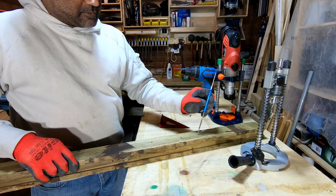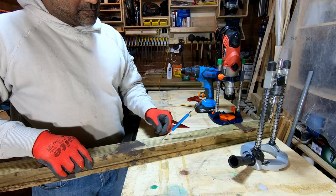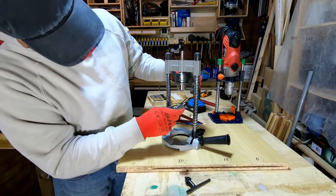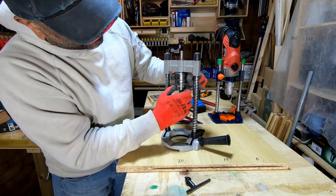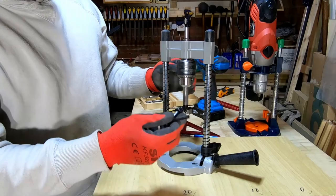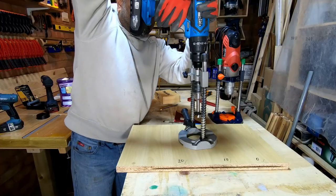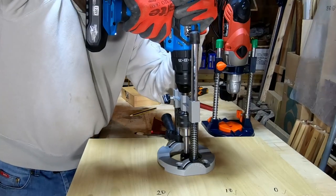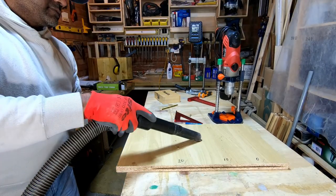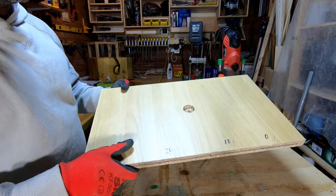With 90 degrees — no surprise — it's actually pretty good. One of the major reasons you'd use this kind of jig is when you don't have a drill press, or when you want to drill a straight hole somewhere in the middle of a panel. I'm going to use a Forstner bit to demonstrate. As you can see it's pretty flawless — always dead on straight, as long as you've got the whole thing bolted up accurately.